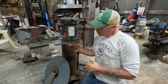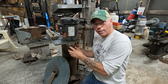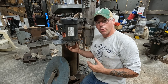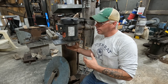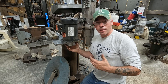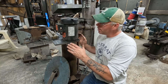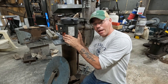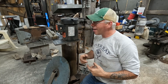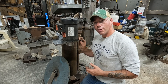More of the changes coming with this belt grinder: we have a just-under four-inch drive wheel on this currently, but we're switching to about a six-and-a-quarter-inch wheel, which will give us a much higher belt speed. Obviously we can dial that back with the VFD and speed control, but that's the beauty of having a VFD — it makes everything really nice. I'll need the old grinder available so we can get the tool arm set up, and we'll get as far as we can tonight and see what develops.